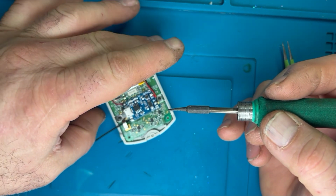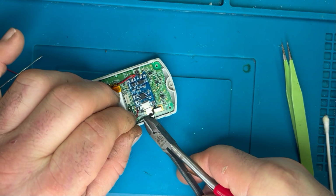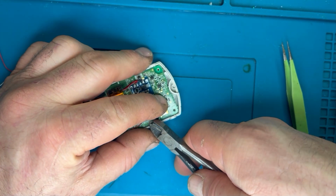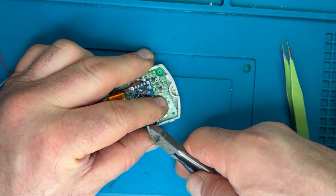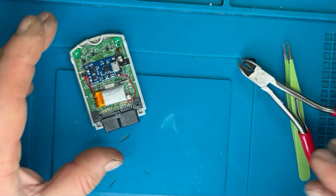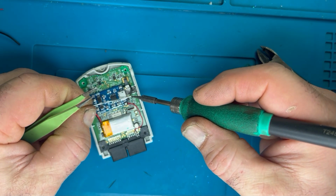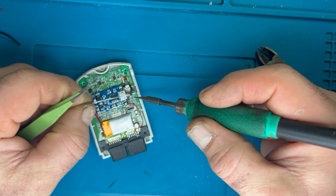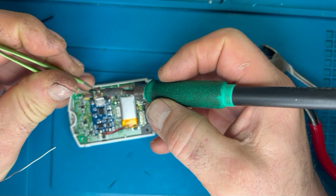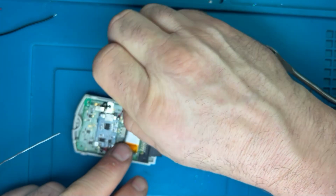Go. That's set, so we're okay there. So we're just going to take a little fly lead round the corner and just ground that on that little stainless bracket that we've pre-tinned. So now what we've basically got is a charging battery. There's nothing connected to the VMU itself yet. So all this is doing so far is we've taken charge power from the Dreamcast to charge the lipo.